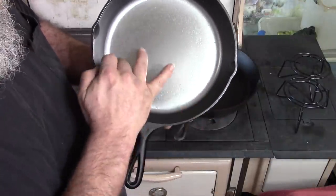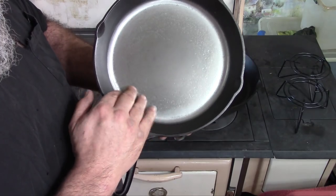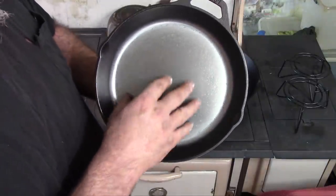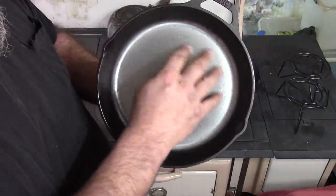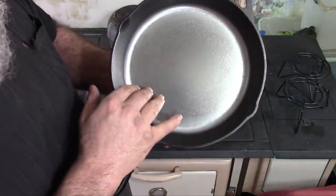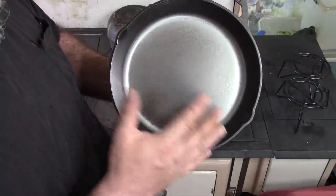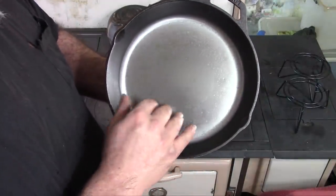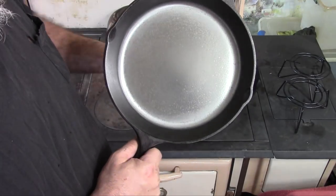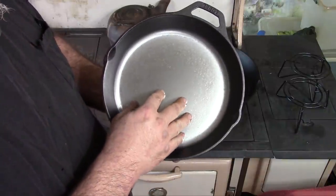You can see there's a few little deeper pits here and there that I didn't get out, and there's a little bit of pitting around the edges. I didn't take them out because it's really nice and smooth already, and you reach a point of diminishing returns. The first 15 or 20 minutes you'll get three-fourths of the way to this point — you'll really smooth it up a lot. After that, it takes longer and longer to get the surface down to where you get the really fine little pitting out. It might take a couple more hours to get it all entirely smooth, but it's not really worth the time and trouble.